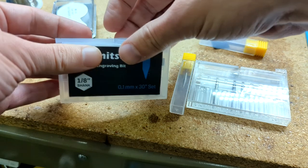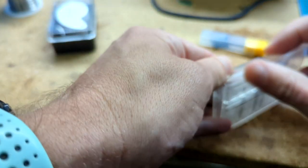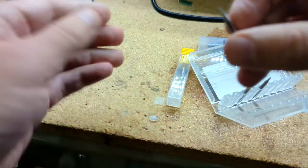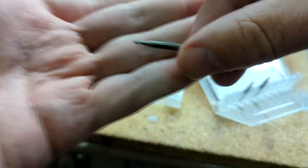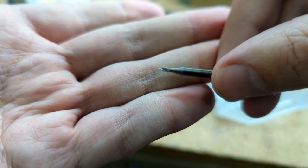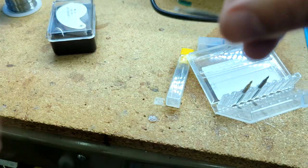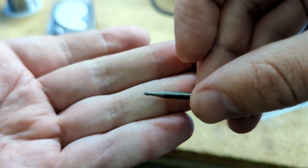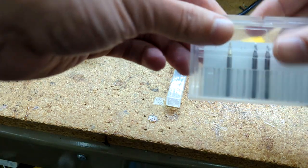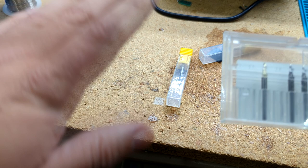A lot of people go with 30-degree bits and seem to like them. The next ones are the high-end bits — those other bits were a buck a bit or less, these are about $15 a bit. This is a specialty bit I'll link in the description. It has an actual cutting flute and it's designed to cut PCBs at a 45-degree cutting angle, so depth is a little bit important. This gives excellent results and it lasts a long time, but if you make a mistake it'll break just as quickly as any other bit. I don't recommend going straight to these — graduate to them after you're really confident about your process.